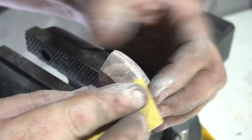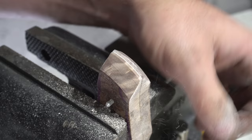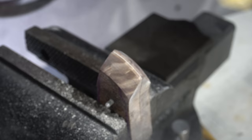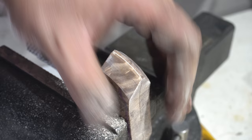Here I decided to show you guys my grit progression when I'm sanding handles. I always start at 220, then to 400, then to 800, and then to 1000 grit. If I get all the way up to 1000 grit and then later buff it, I get a super nice sheen on it and it ends up being really shiny and beautiful.